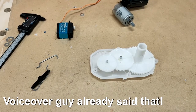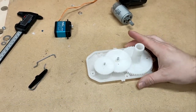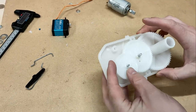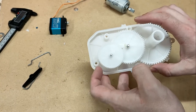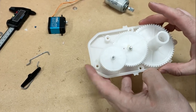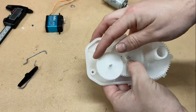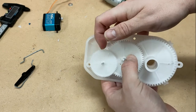We're going to have a look at the steering and how this works on the car. This is the original steering assembly — basically there's a motor which powers this gear, which then turns the middle gear. You'll notice it's not turning the big gear; what you have to do is push that gear down and then it will start to turn that big gear.